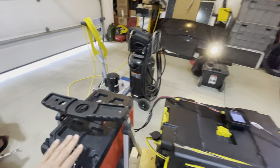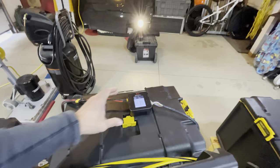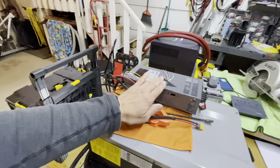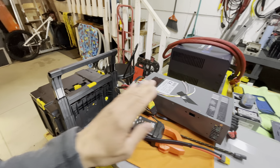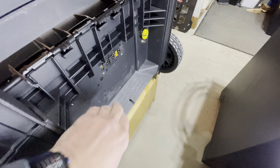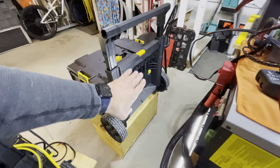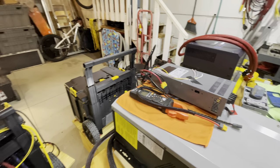In this case I'm charging this 24-volt battery from a 12-volt battery — the charge controller handles that. If you want to use a traditional AC charger it'll handle up to 30 amps. The MPPT ports on this unit are rated for 20 to 24 amps; the newer version will be rated up to 50 amps. That limits you to maybe three or four MPPTs, but you can put whatever charge controller or charger you want in there and the ElectroDacus will control it — for example, a 1,200-watt charger.